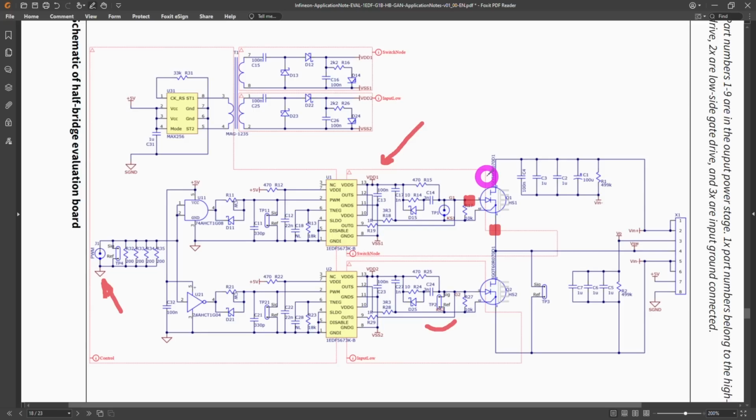So let's go ahead and build this and put all of our setups together so we can use an external power supply, and then we can change the power supply voltage, 50 volts, 100 volts, 300, 400 volts, and see if we can maintain that nice view of the gate source voltage and see the subtle minor differences as the device goes in and out of various conduction regions.